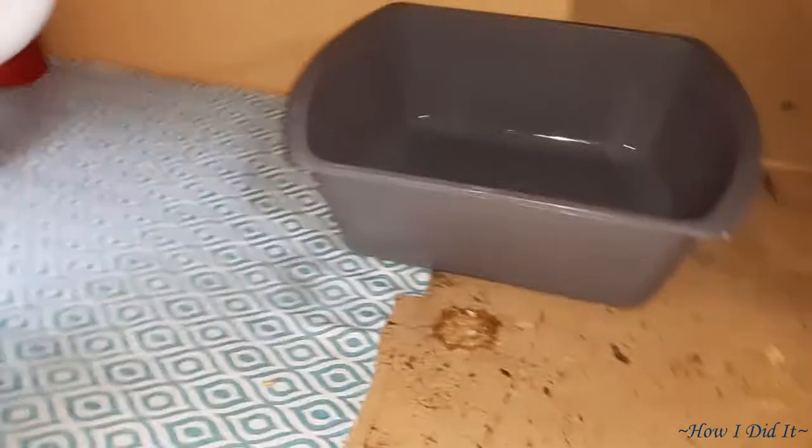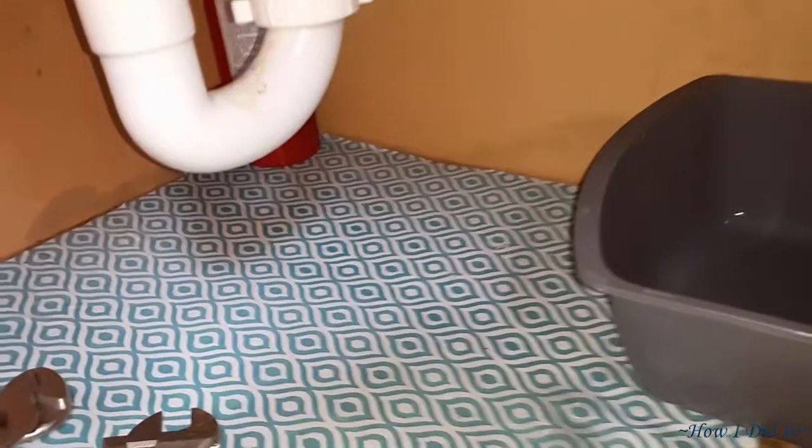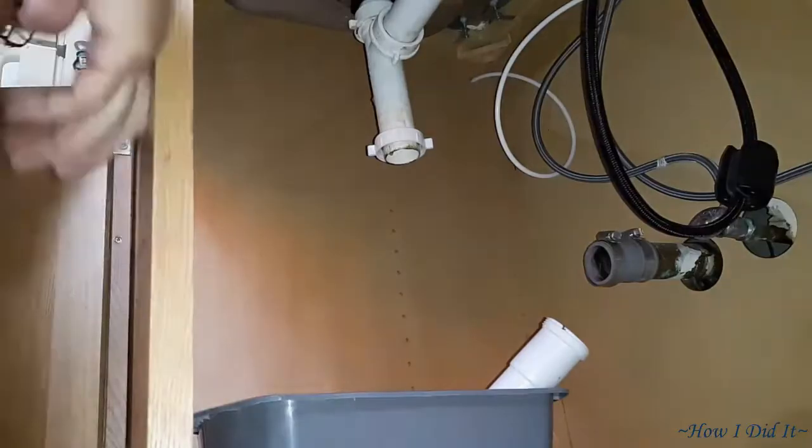Alright, so we're back over here. I'm going to pull this particle board out of the bottom. It was so rotted, so for redundancy, I did not film me pulling this out. Once I busted a hole in the bottom, I was able to push it all down and then work all the nails and stuff out of the framework itself. And then to make things easier, I did end up removing the P-trap and part of the plumbing on the sink. It's pretty straightforward. Two screws hold the adapter onto that tail that goes out, the drain tail, whatever they call it.